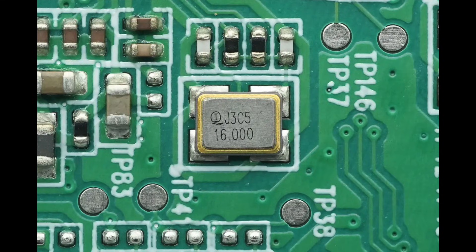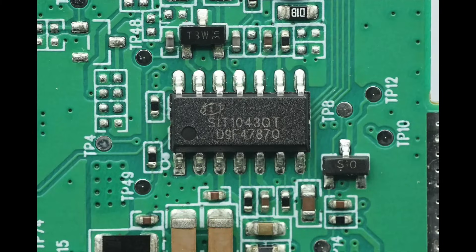Close-up of the 16 megahertz clock crystal oscillator. The CAN transceiver is from SIT, model SIT1043Q. It is AEC-Q100 certified and compatible with ISO 11898-2:2016 and SAEJ2284-1 to SAEJ2284-5 standards. The transceiver features low standby power consumption and a standby mode, with support for both remote and local wake-up functions. It supports a voltage tolerance of plus or minus 58 volts and is suitable for MCU applications with a 3.3 volts or 5 volts power supply. The chip comes in an SOP14 package.